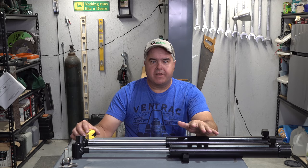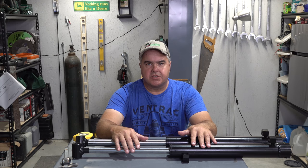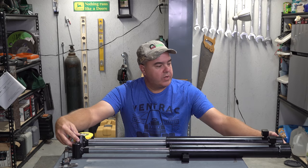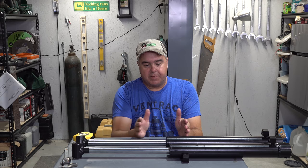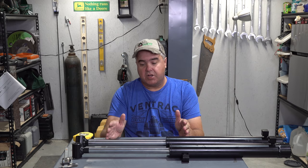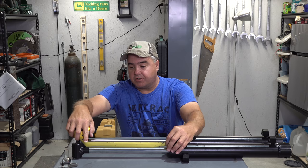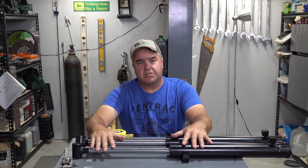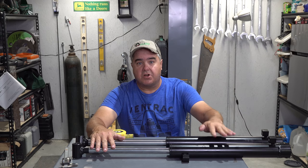Before I go any further, I want to tell you about a viewer friend who's been working with me behind the scenes. He found a cylinder on Surplus Center which is a little bit different in size — I'll put the links in the description. It's about the same width; he did say he had to grind a little on one end to make it fit. It's a little different on the expanded and contracted length — it's a 12-inch stroke, where these appear to have about a 13 and 7/16 stroke and about a 13 and 1/8 stroke. His 12-inch cylinder from Surplus Center, all in with adapters to get the same thread sizes, is $170.